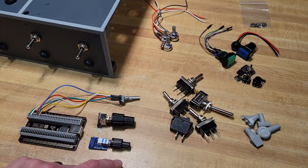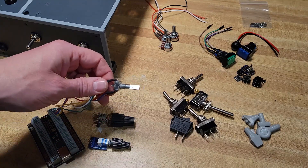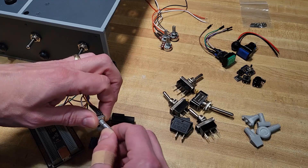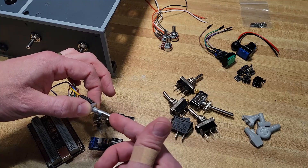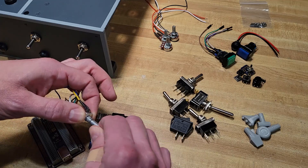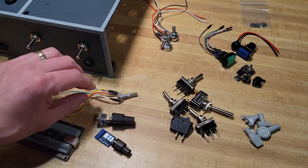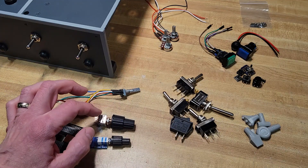The encoders I've discovered that I really like are made by Bourns. They're high detent, meaning you feel a lot of force as you turn them. I always buy the kind that are 16 detents all the way around - they range from 16 to 24 clicks before you make a 360 degree turn. I go for the high detent 16 because it just feels more tactile.